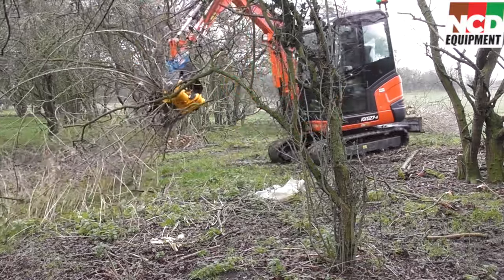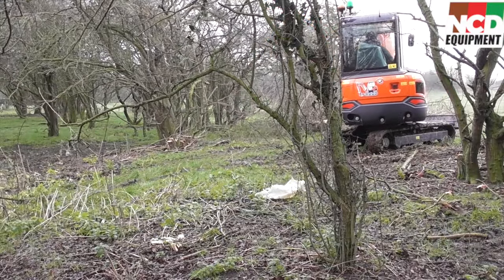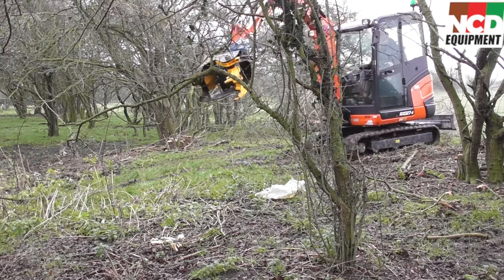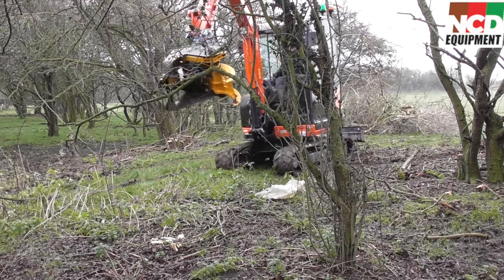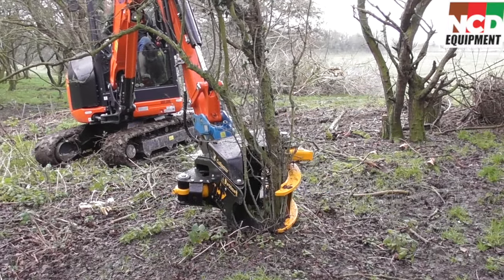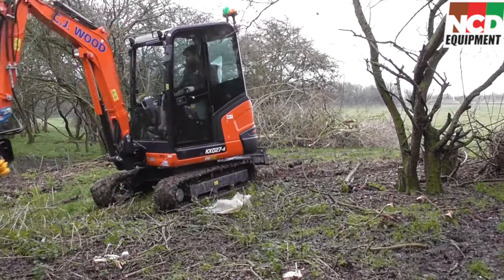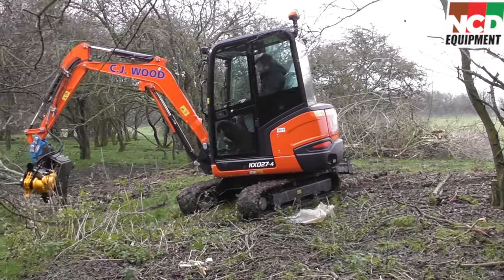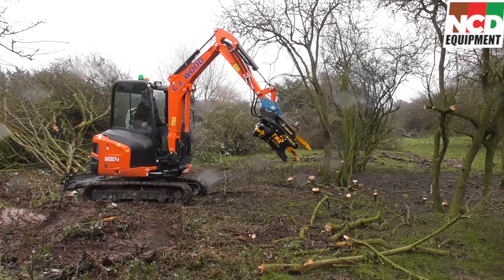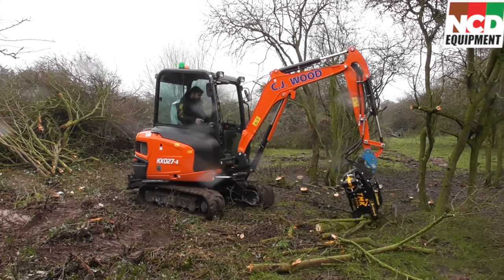Every time I operate TNK tree shears they just always blow me away, and this little 200 impresses me even more — what you can handle with a two and a half to three ton machine is just phenomenal. With just a standard cylinder and the right pressures, the basic tree shear would be cutting 200mm all day long, but just adding these attachments like the brush blade and the turbo cylinder makes it so much more efficient. The speed, the ability to cut and hold multiple different trees, even cutting the little small bits of timber — this little clip of the collector working was 2.1 minutes long and it just shows how quick you can do that. I used to work on chainsaws cutting vegetation down the railways and when it was horrible bits of wood intertwined like that it was nothing but a pain.